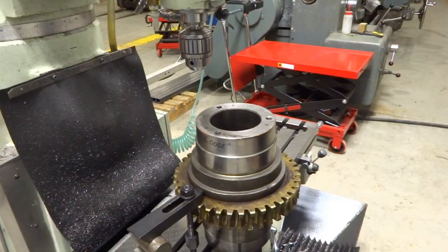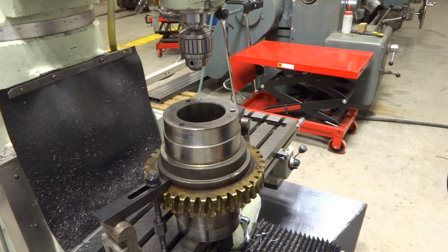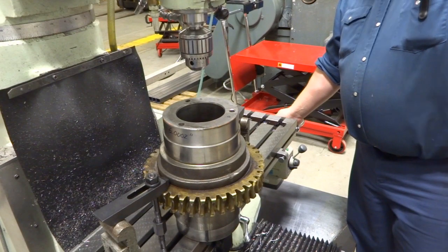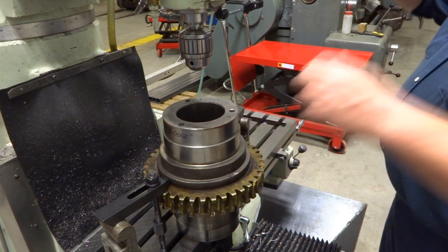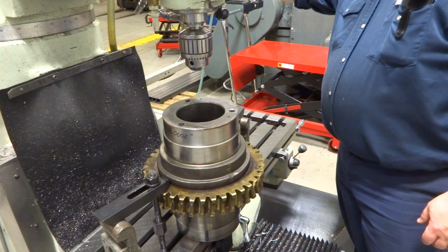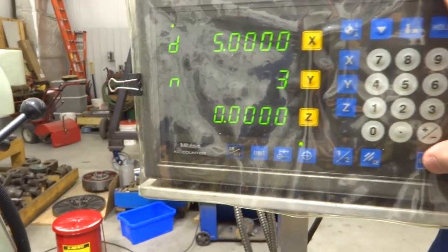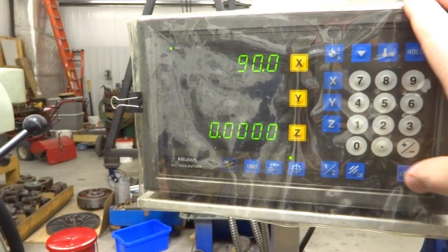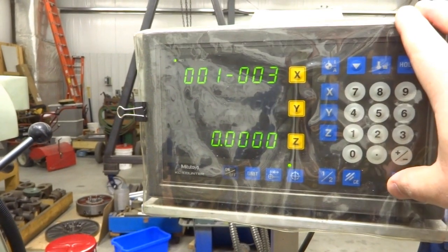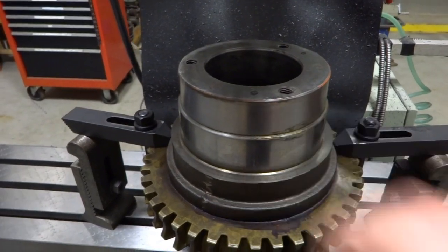You have to go back to zero-zero on the readout before entering the bolt circle function, because it will assume the center of the hole is wherever the table is sitting when you enter it. So you have to put the table back to the center of the shaft, then start the bolt circle function — otherwise it won't be centered on the shaft. I selected a five-inch diameter, which is unchanged from the last time. Number three, angle to the first hole is the same. We load hole number one and it says we have to come straight across on the Y-axis, so it's all pretty straightforward.